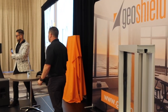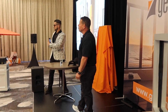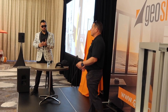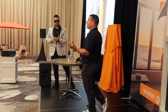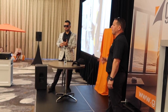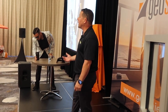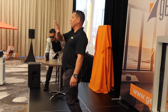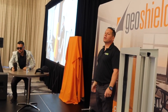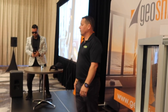Is there any kind of attachment system recommended for residential? I don't do a lot of residential windows. However, there are mechanical options — Pentagon, for example. You can get ahold of them — they have different types of attachment. You've got to miter the corners and try to make it look good. There's a guy in Dallas, Texas, that's got a metal mullion he just got his patent on for doors. It actually goes across the frame, across the top, and down to the window. I don't know if he's selling that product yet, but you would actually have to take a chop saw, miter it, and cut it on site. It's a good product.